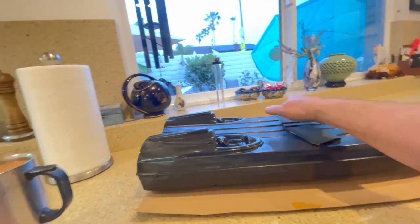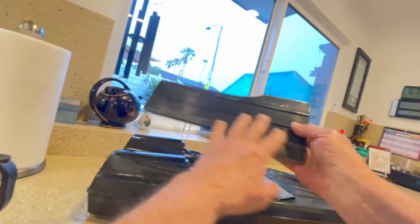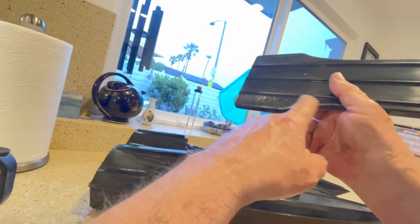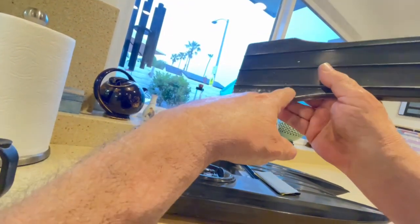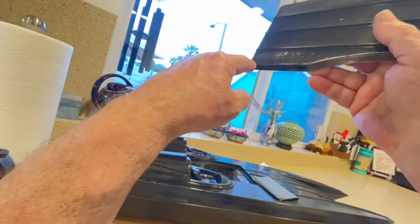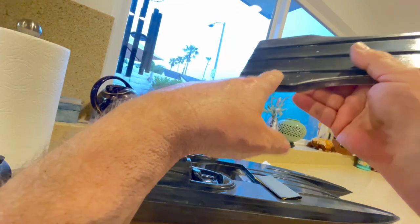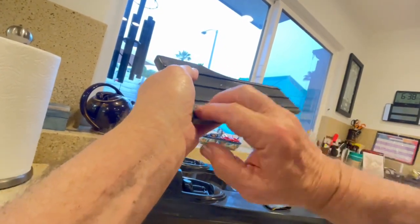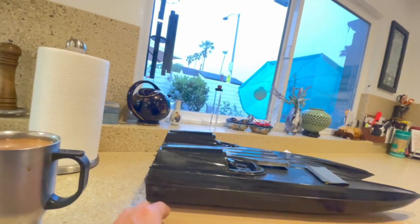I've been hitting this with some sandpaper. When the whole boat looks like this, it'll be ready to recoat. Interestingly enough, check this out — when I sprayed on the primer, a lot of places I let it go on dry, and you can see the specks of dryness as I sand down. Now it's perfectly smooth. But I'm thinking in areas where you're going to be taping up, maybe that'll get you a better bond between your color coat and your primer. Because there have been times when I've pulled up tape and, when I get the primer really nice and smooth — surface prep — and I get it really nice and smooth, the paint doesn't stick to it very well. So I decided to leave a little tooth in the primer this time and knock down the first tack coat instead. That's part of what I'm doing here. I didn't really sand out the primer that much, so we're going to see.